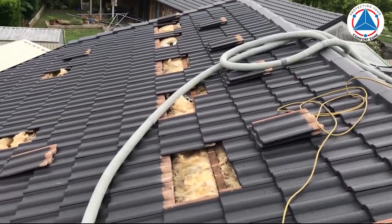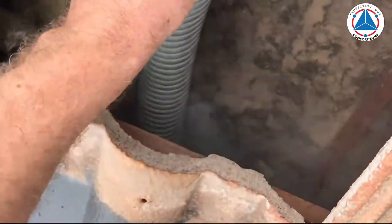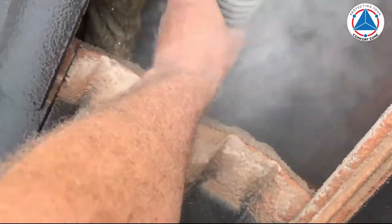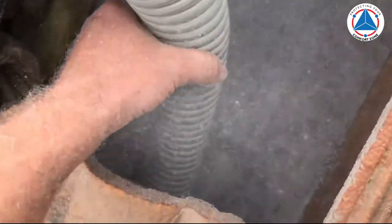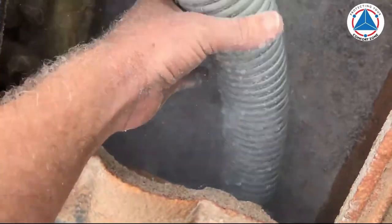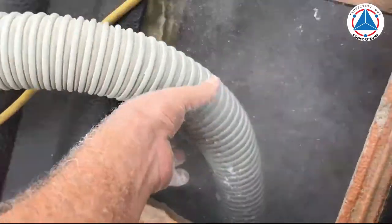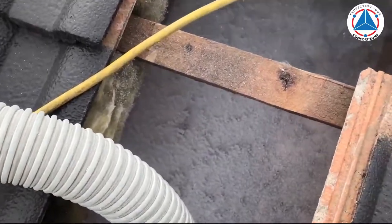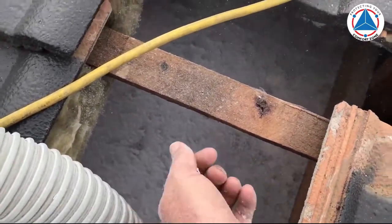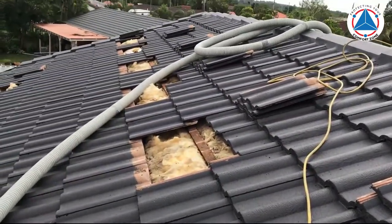Okay, just here doing this raked tile roof and we're just pumping the cellulose fiber in. I've got the hose right down in there and you can see down the bottom there — it's only half a bay — but we literally just pump insulation into these until we fill them up. Then I'll put the hose up that way and pump into it up that way. That's how we do a raked section.